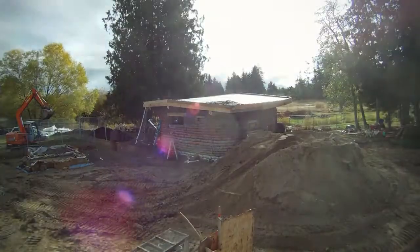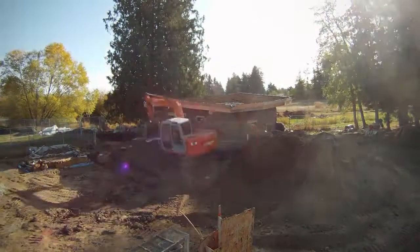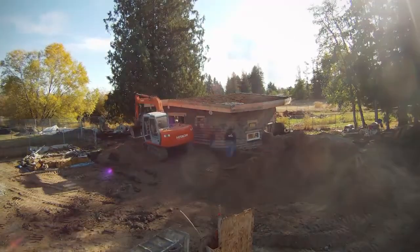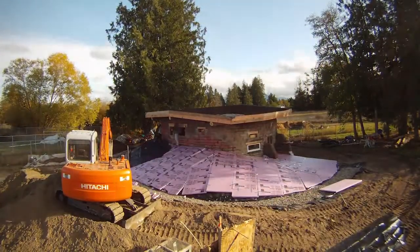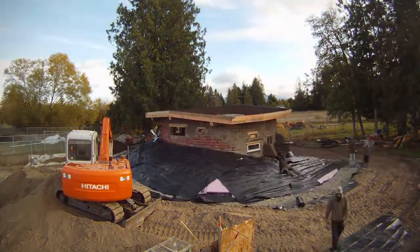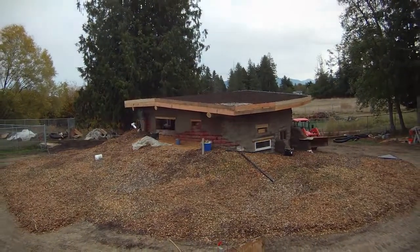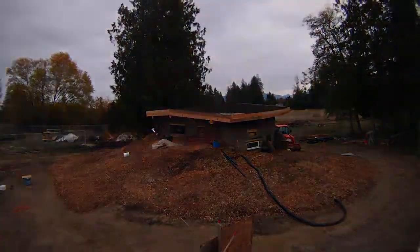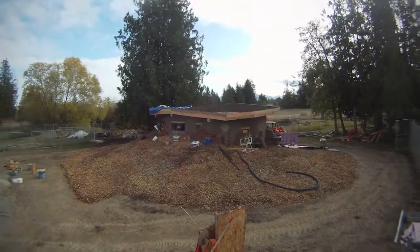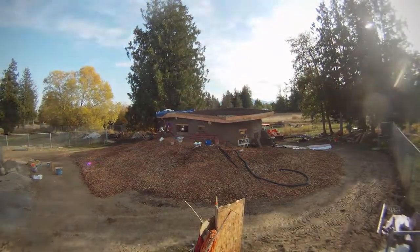The track hoe lifted the soil onto the roof which we then spread by hand. We also used the track hoe to build the berm around the structure. Then we laid layers of black plastic and rigid insulation over the berm, covering it up with a thick layer of wood chips. These layers keep the house and the soil around it dry and warm, allowing us to store the summer heat in the berm to be released over the winter. This technique is known as passive annual heat storage.